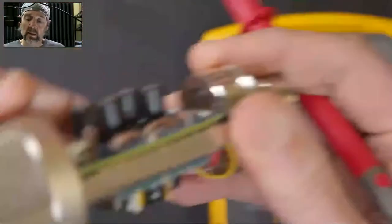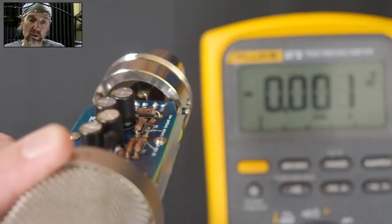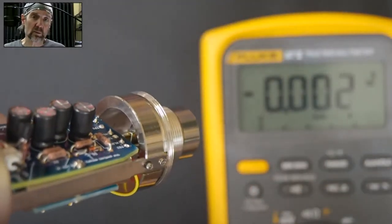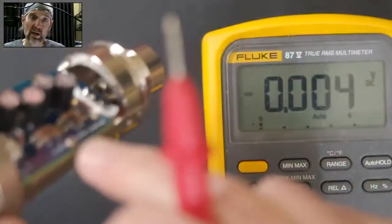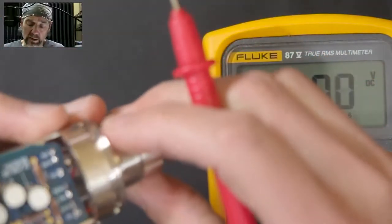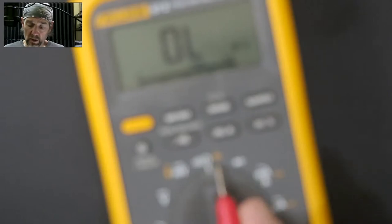Let's take a quick look at that to demonstrate. Here's a typical XLR three jack — pin one, pin two, pin three. When you look at it, it's not one-two-three in order because you're looking at the other end of it. So it's one, two, three on the bottom. If you don't make that mental transposition, you risk connecting XLR pin two to the XLR pin one pad on the circuit board. It's happened a bunch. The way to be sure which wire you're dealing with is to put the meter into continuity mode.